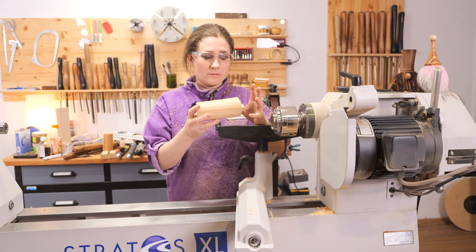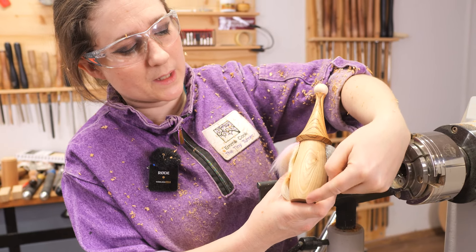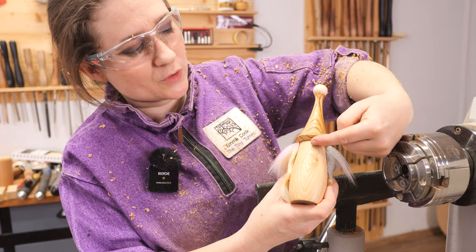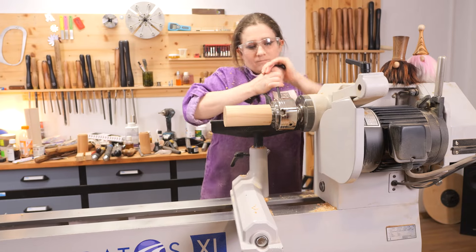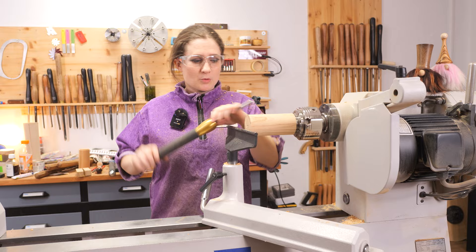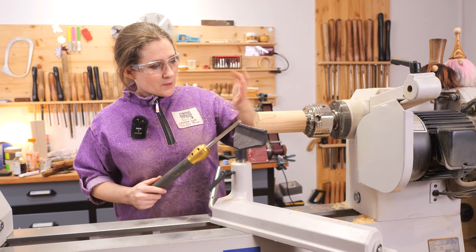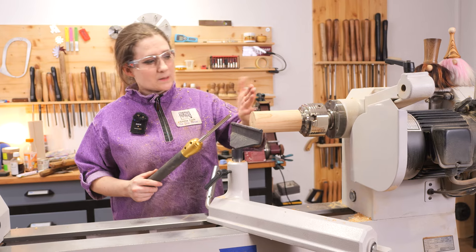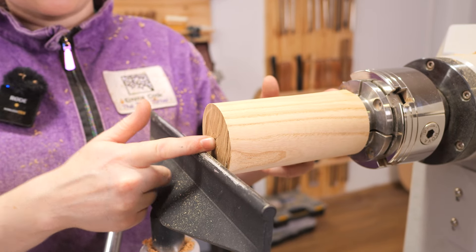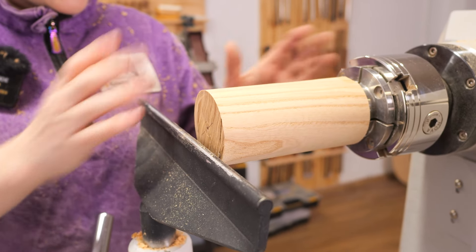Now these are all rounded off, we're going to concentrate on the body. We want it quite rounded at the bottom and keep the diameter there, then bring this down and decrease the diameter towards the top so that we can get this overhang of the hat. A lot of this project I'm going to turn with a quarter-inch bowl gouge with a short handle because it's nice and maneuverable. The first thing we need to do with the underneath is clean it up and make it slightly concave so that it will sit on the widest point — that way if the wood warps it's less likely to wobble. This is quite a long piece of timber to have unsupported with the tailstock so be very, very careful with your cuts — nice and gentle cuts because we don't want a catch to pull it out of the chuck.